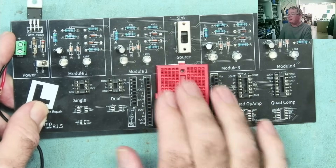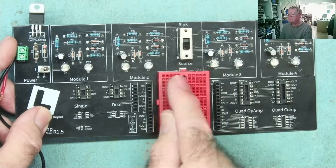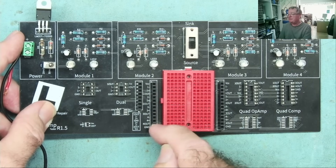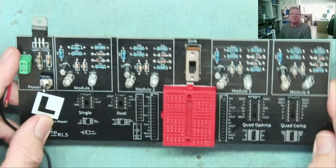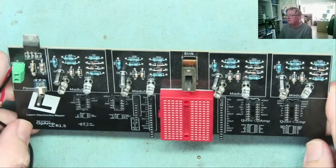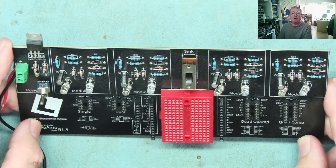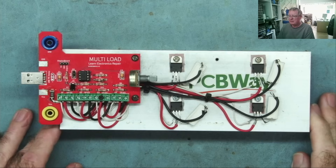You can put single in line eight pin ones, and there's a little breadboard in the middle where you can plug any op amps with an unusual pin out. You can connect the various test signals you want — all the inverted and non-inverted inputs and outputs, power, and ground. So you can pretty much use this to test any sort of op amp. I use this regularly, and I've successfully used it to find faulty op amps, especially in audio equipment I'm repairing.